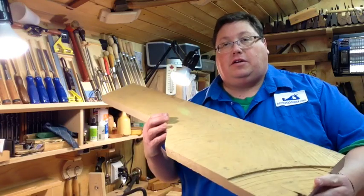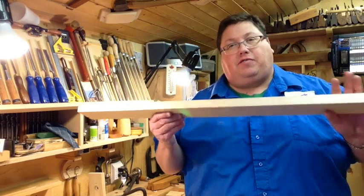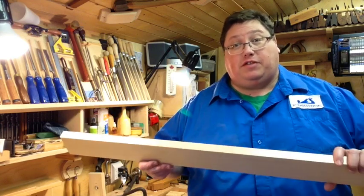While we humans were born with only two hands, the workbench is like a little crew of tiny woodworkers ready to hold your work so that cuts can be made safely and boards can be made flat, smooth, and square. I'll talk about woodworking basics so you understand how a rough board becomes a board that is four square — six faces that are flat, smooth, and at 90 degrees to all the other faces. There are only three processes involved in doing that, and I'll show you how the workbench takes care of all three.